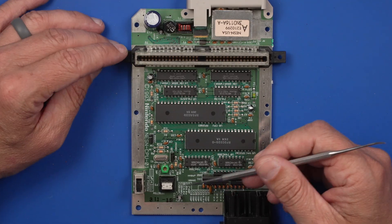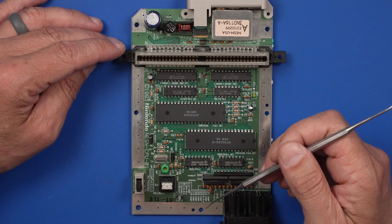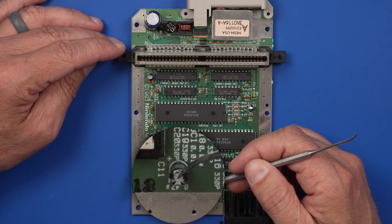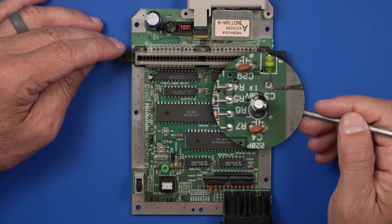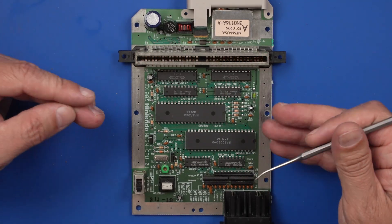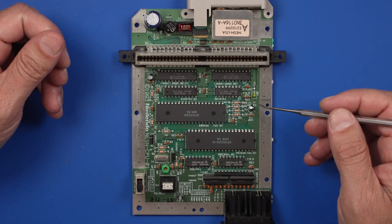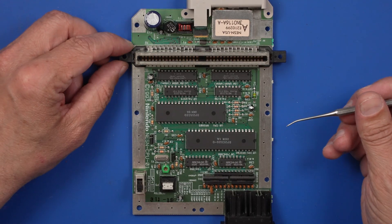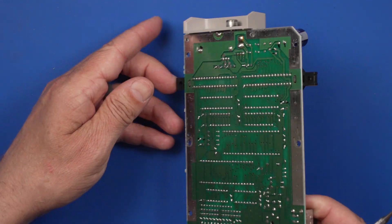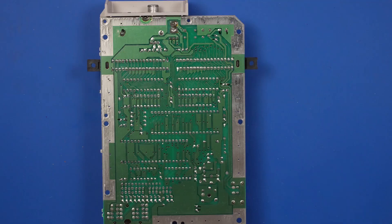While we have this thing apart, it would be a shame to not replace all the capacitors. These capacitors, for the most part, look pretty good — this one looks like maybe there's a bulge; maybe there's one there, it's kind of hard to tell. Either way, they're probably fine, but since we're already in here doing all this work, we might as well just replace them. I'm going to use the large soldering iron along with some solder wick to remove the solder on the legs of these capacitors underneath the board, then pull the capacitor out and install the new one.